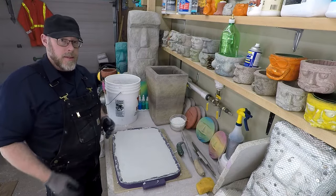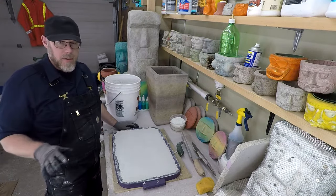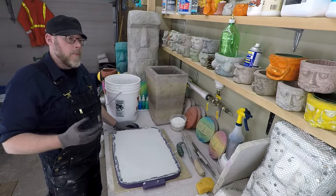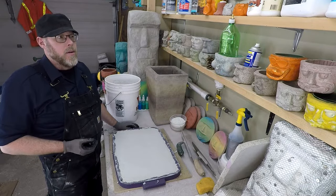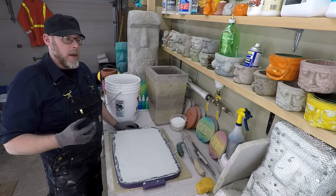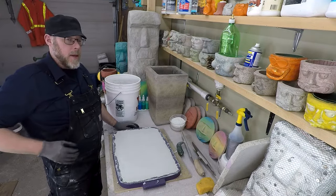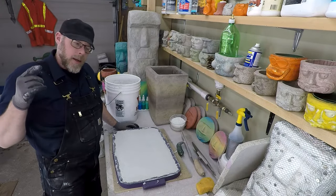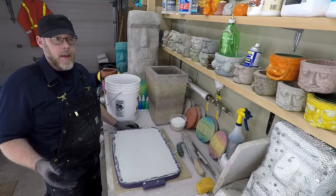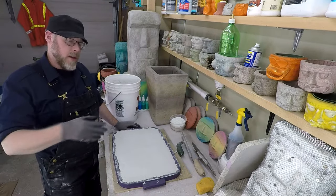How much water should you use? As much as it takes to make sure it's wet. There are different climates, wind levels, and temperatures that all come into play, so basically just keep it wet — if it looks dry, add more. Concrete stays moist for a long time in most environments, but if possible, the first week and especially the first three days, keep it soaked five to ten times a day. For applications where strength is of paramount importance, just run a sprinkler the whole time and never let it dry out.